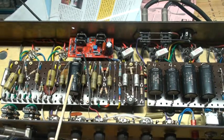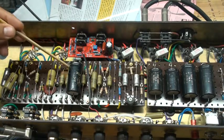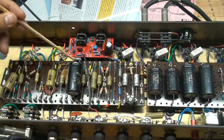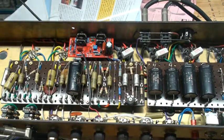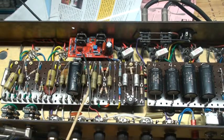This is a 33µF preamp filter cap. It has one 10K resistor running across this way, and then you have a 10K resistor here. I have another 0.022µF capacitor here, and here's my phase inverter section, which is a 1 meg, 470 ohm, 1 meg, and then 10K here at the tail.